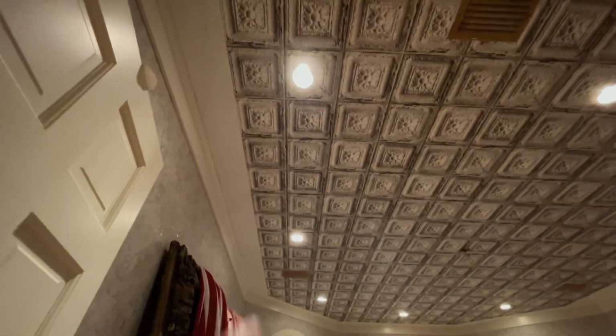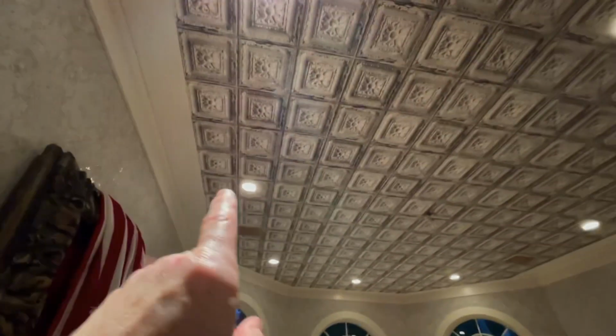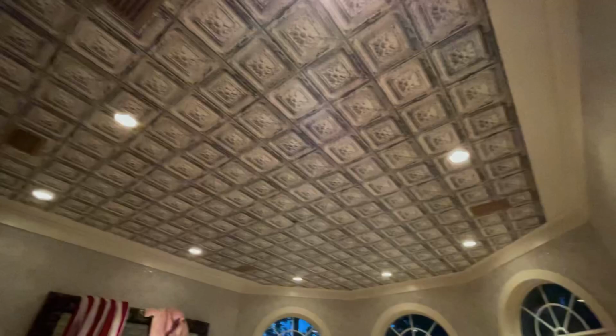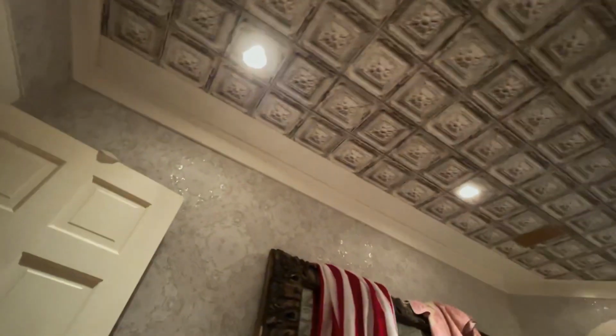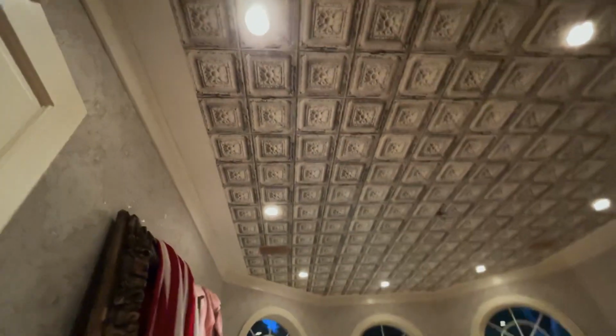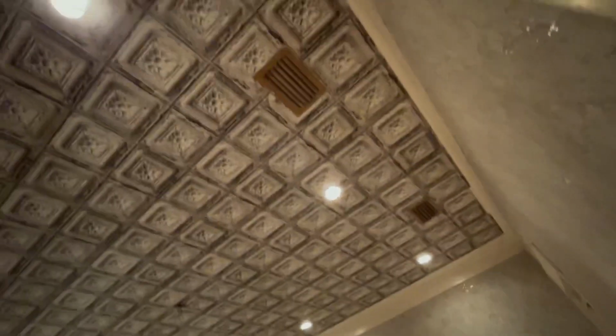We have the piece over here. Note the distance between wallpaper and wall, and you'll see the same distance over here. And that is the reason why we start in the middle. So if you're a do-it-yourselfer and you have these squares, right, or triangles, you want to get an equal amount of triangles or squares on each side, okay? You may not have a square or rectangular room, so you plan accordingly. But we're almost there.